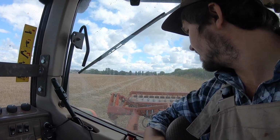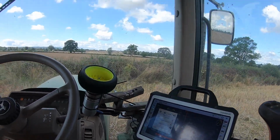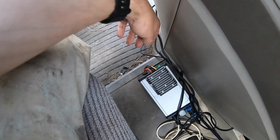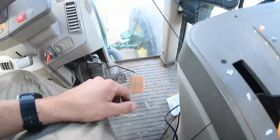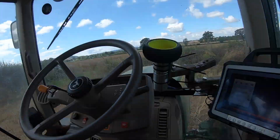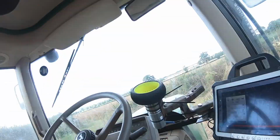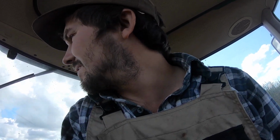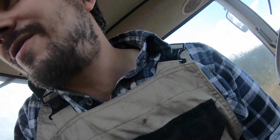And I've also got the latest update to my GPS system. So very rough and ready, but it's no longer just a circuit board. That's the control circuit for, and that's a voltage converter for the motor. That's the circuit board that controls the steering. Got a wheel angle sensor down there that still needs a bit of polishing. That's not great, and actually almost ripped the cable off with a long bit of rake stubble. So yeah, just a few bits to iron out of there.